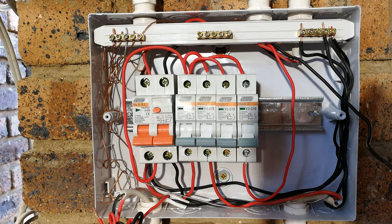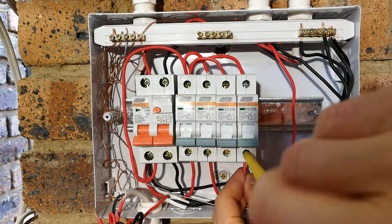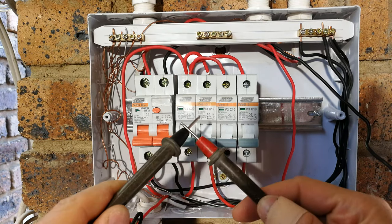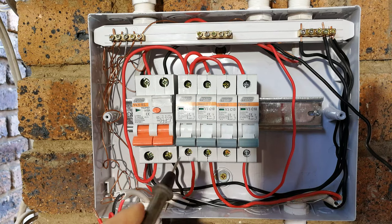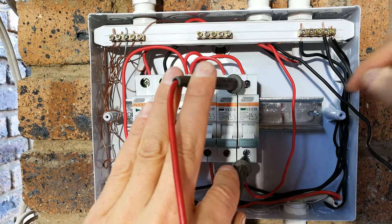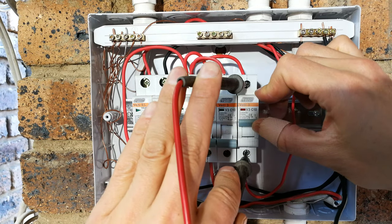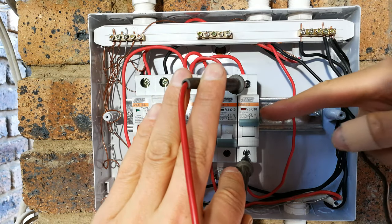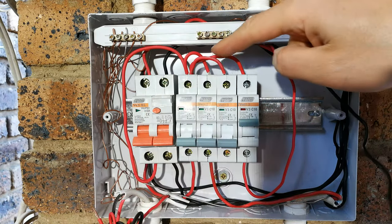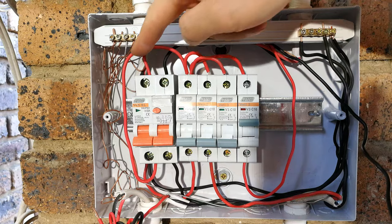So the circuit breaker is down, there's no continuity. I've wired the live to the bottom of the circuit breaker. Just so you understand how that works, I'll show you in terms of continuity. This is measuring a short circuit, and if you look across the circuit breaker, you can see there's no short circuit. But when I switch it on, you can hear continuity, which means that when it's down, it breaks the circuit, and when it's up, it allows current to flow, which means current coming into the DB